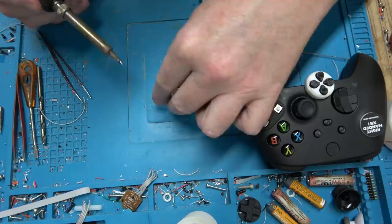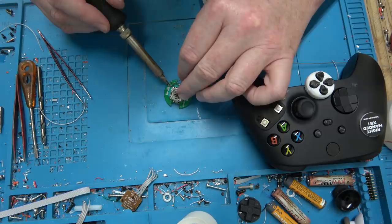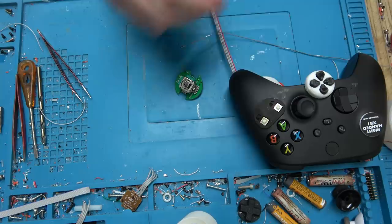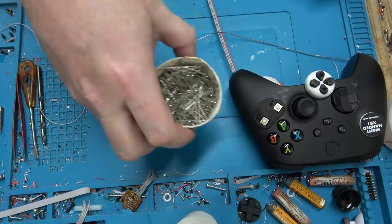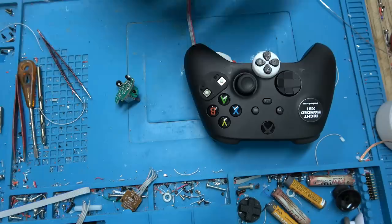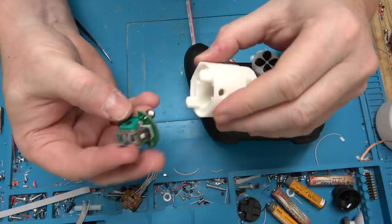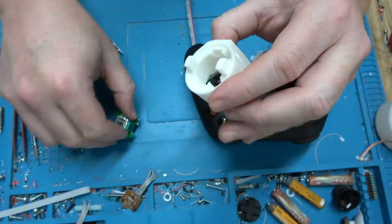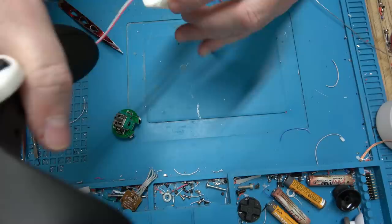The up and down doesn't invert because it's the same either way, so those solder blobs just invert the X connections, because that does change depending on how you orient the board. We have our adjustment pots here going the opposite way of the analog stick. One negative is it's not obvious where the center point is, but I just plug it into the computer and tweak the center point once it's all built — not a big deal. Before, I had to stick in the pots, glue them in place, attach a bunch of thin wires — now it's pretty easy, just attach things to a circuit board, saving myself time so I don't have to raise the price.